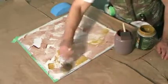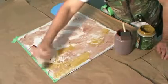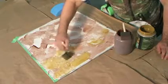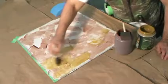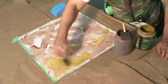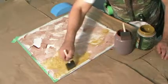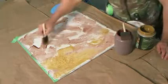The missed areas will be done with the second glaze application. Work the glaze into some of the recessed areas and any stencil relief pattern. Once you have covered an area with the first color, you can begin with the second color glaze. The second color glaze application should be worked into the previously unglazed areas and stencil relief patterns, but still allowing some of the original Versi-Plast color to remain exposed.